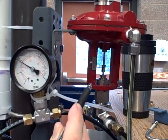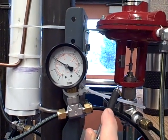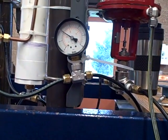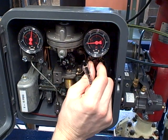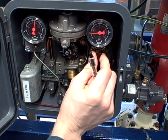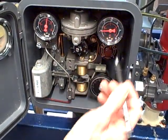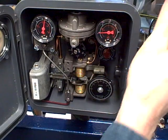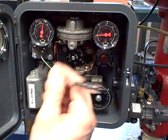When we do that and look back up here, we'll notice the valve starts to cycle. In fact, the process pressure starts to cycle as well — the controller is overreacting. This is not something that we want. It's a great demonstration of what happens when we have too much gain in the process. I've got to come back to my gain adjustment and temper that a bit until it steadies. It's exactly like an electronic amplifier circuit that has too much gain — it gets feedback and starts to oscillate. This gain adjustment is really like the gain of an amplifier: it changes how much the output will swing for a given input change. If that's too high, the feedback will start to oscillate.